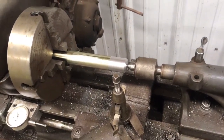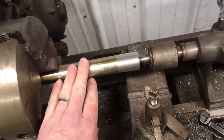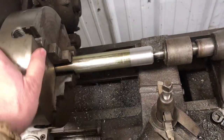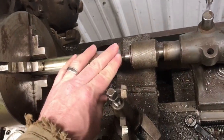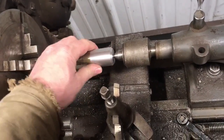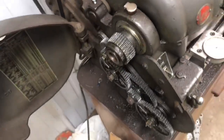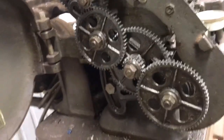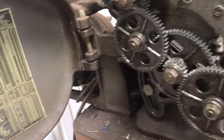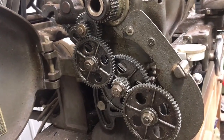So it's actually been a couple days since the last clip was taken, so I've had time to mess with it. I've got this indicated in the chuck, got our center drilled in it, got the OD here turned down to the correct diameter for the thread, got our live center in. What I'm getting ready to do now is set up our gearing. This lathe does not have a quick change gearbox for your feed rates, so you have to set the gears up for whatever thread or feed you want to run.